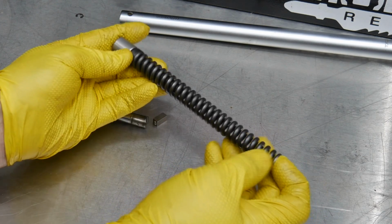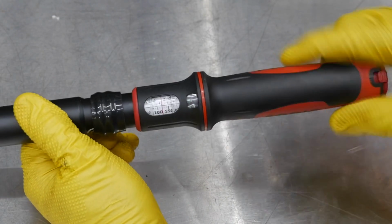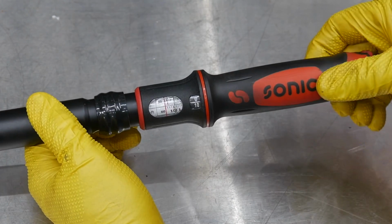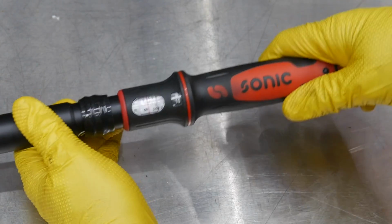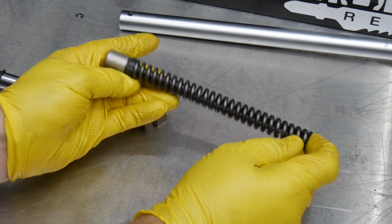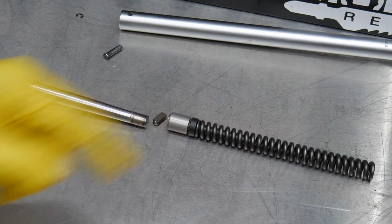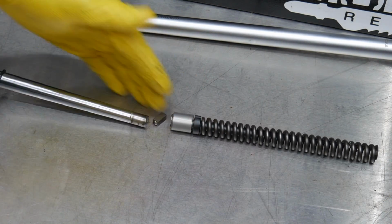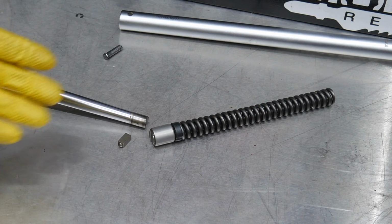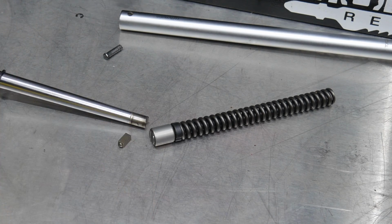If this is not calibrated from time to time, also if you're not returning it back to zero or back to the lowest setting, you're going to fatigue the spring, and therefore it's going to be reading incorrectly, and you're going to be basically torquing bolts to the wrong amount, if you will. So make sure you get your torque wrenches calibrated, and hopefully that gives you a little better idea of how a torque wrench works, of how the clicking happens, of how the positive detent in the handle itself happens.